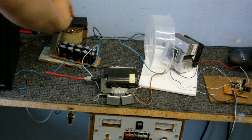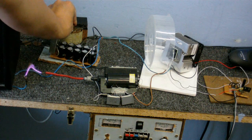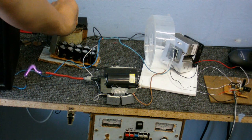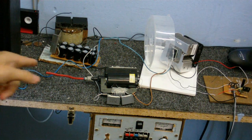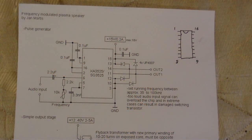I'm going with a single MOSFET driver — that worked really good. Next stop: FM modulated singing arc. We know this thing works, connect up the power and it arcs. I can't do that for much longer because the heat coming off it is just incredible. So this is the part I'm going to build now — it's a fairly simple circuit using a KA3525 or SG3525 chip. I couldn't find any KA3525s locally stocked, so I got an SG3525, which is the same thing. I'm also drawing a little picture of the chip for reference so I know which pins are which.